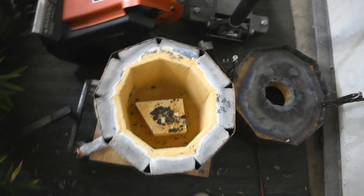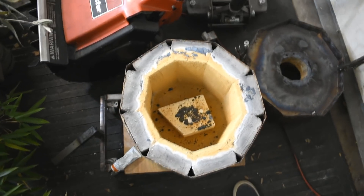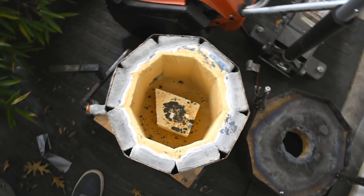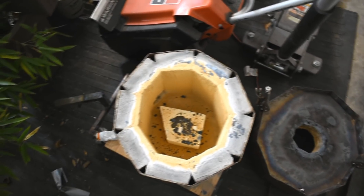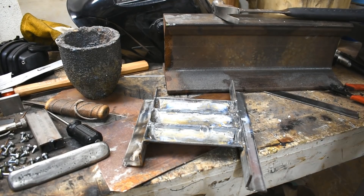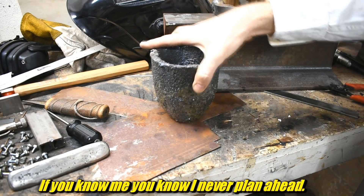I don't have heavy refractory cement inside, so this has far less thermal mass and heats up really quickly. But these bricks were the same temperature rating, and the Satanite over the top is actually a higher temperature rating than the refractory cement they use. So I figured if all the ratings are the same or higher as an iron melting furnace but I only melt copper, it should last forever - and that's kind of worked. But if I melt iron, I'm going to have another issue.